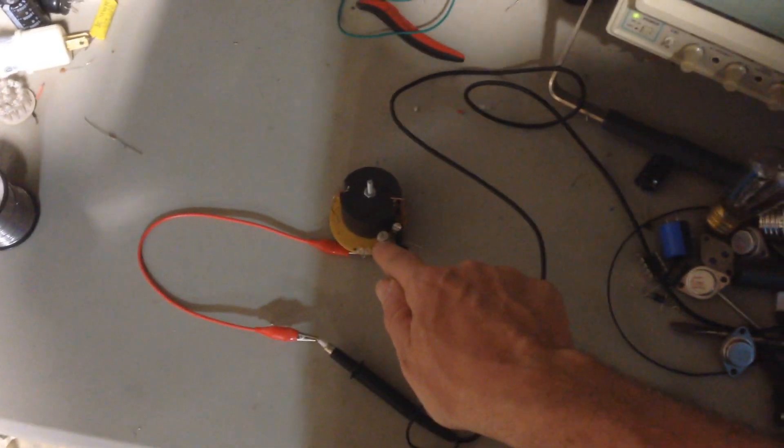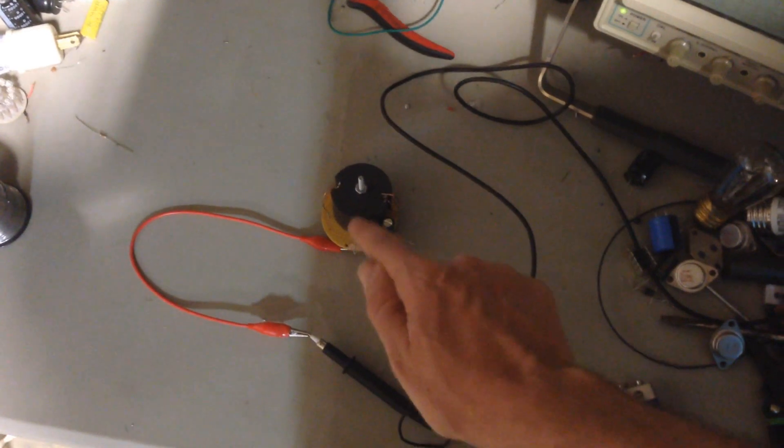When I come from the LEDs and return to the transistor, I connect to the base. That was crucial to getting this to work like this.